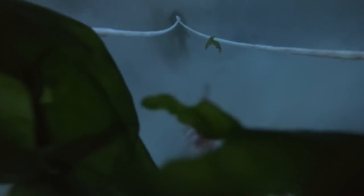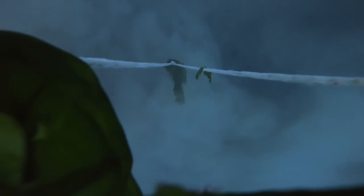Didn't see much on that one, but from the sound we could tell that it did drag a bit and then stop the boat. That one didn't take too long. That was maybe, I'm just going to guess, 3 or 4 anchor lengths. Perfectly acceptable. And when I say acceptable, there really is no standard for this. And I fully acknowledge that these 3.5 knot reversals are quite unrealistic. It certainly can happen, but it's certainly not going to happen very often, maybe once a lifetime. But I just think the test is a good indicator of an anchor's ability to reset under any circumstance where it may become dislodged.